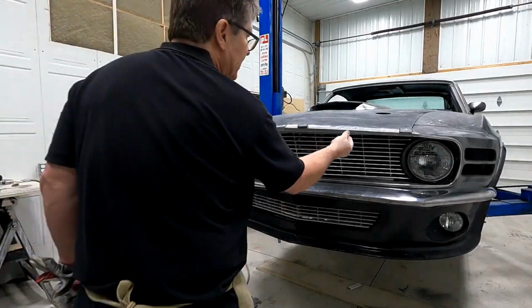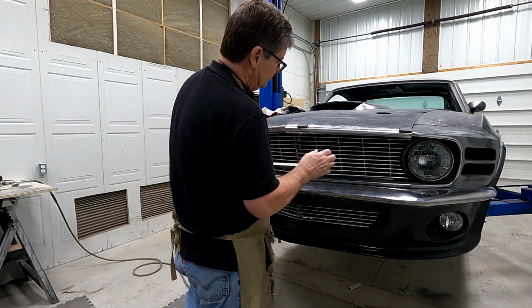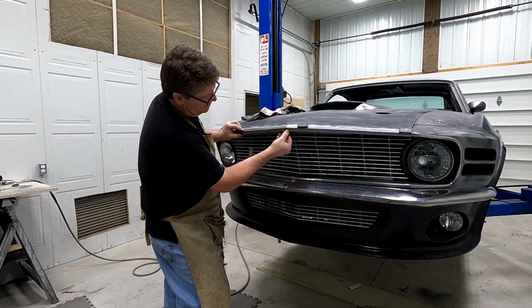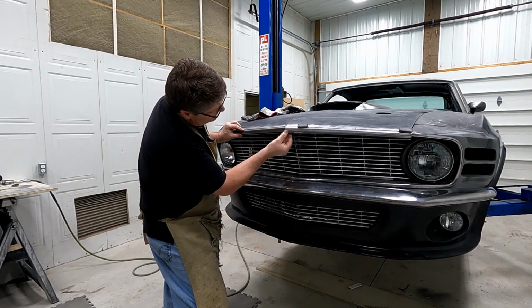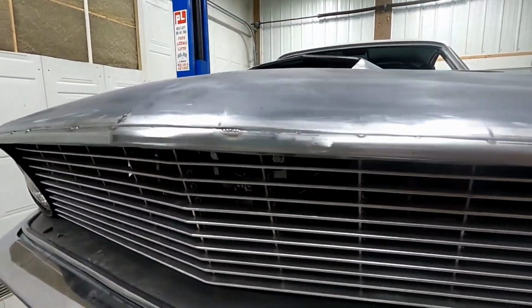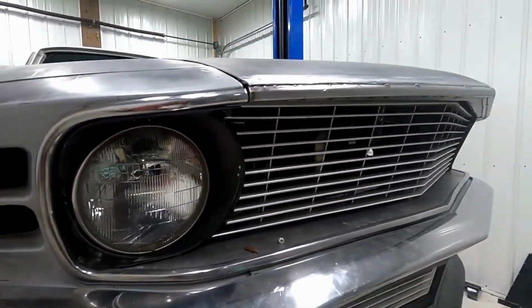So I got this piece just sitting on there. I use magnets a lot. Those will just come in real handy for this kind of stuff. So here's my other one. I'll tweak that a little bit, cut the ends, get those two miters fitting. So I got it all tacked in place. Now I'm going to pull it off and finish welding it on the bench.